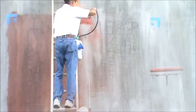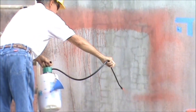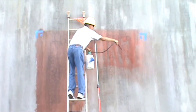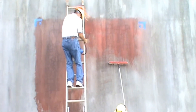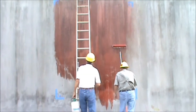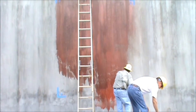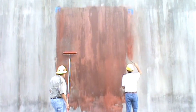This is referred to as dwell time, and it's very important that we keep the surface saturated and wet to allow the deepest penetration possible. You can see that as one person with the spray rig is spraying, another is back rolling, keeping the operation flowing smoothly. This product can be spray, brush, or roller applied. For smaller jobs, a handheld pump sprayer and roller work quite well. For a space larger than this — say the entire surface of this tank — we would use an airless spray setup.